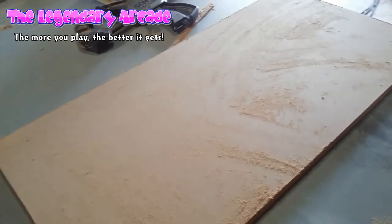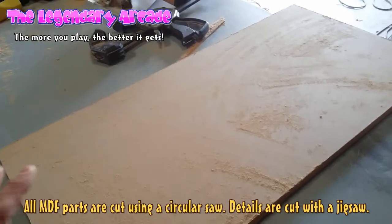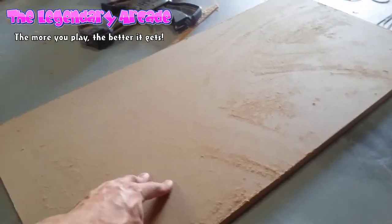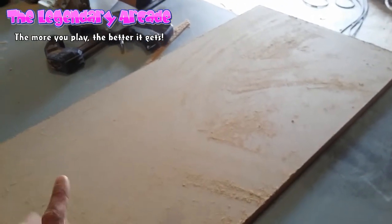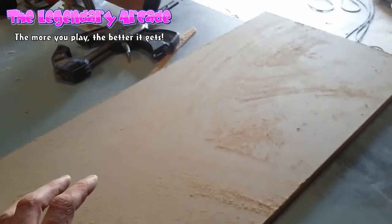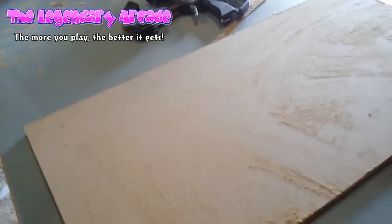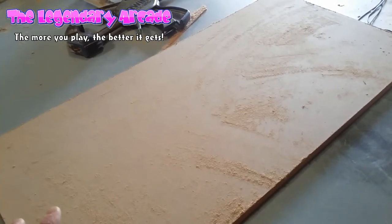I just cut the final piece for the control panel for the Halloween arcade cabinet, and I'm very excited about this project. It's the first time I'm making a cabinet where the control panel consists of an MDF board on top, then the artwork, and then a piece of plexiglass. I'm really excited about the plexiglass part, as I need to cut it to fit the panel perfectly with very clean edges and all the holes for the control buttons drilled without damaging it. The next step is to mark up how the panel is going to look on this piece of MDF board, and then I'll cut the plexiglass using this as a template.